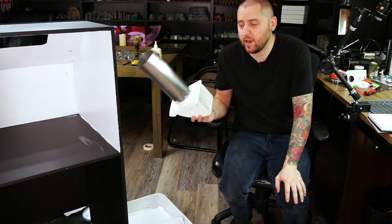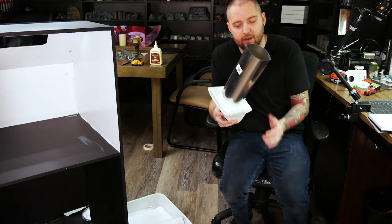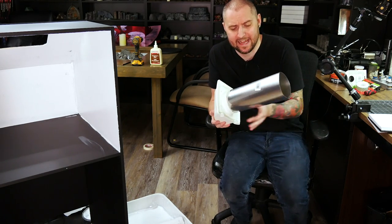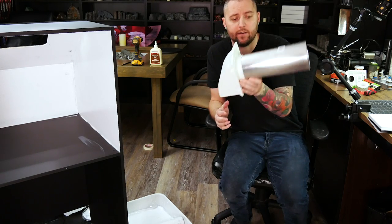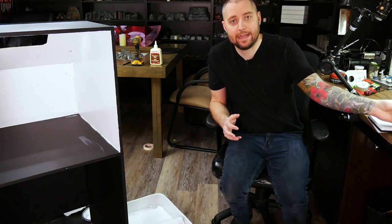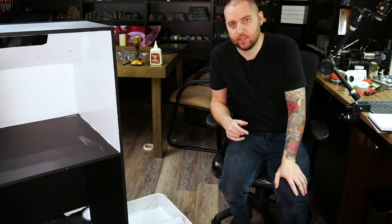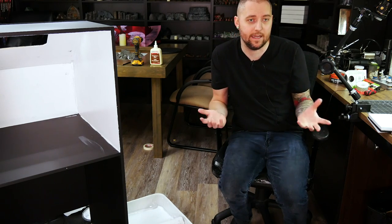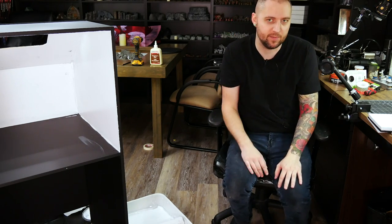While the paint is drying on this thing, I'm gonna start working on the venting, and the biggest part of that task is getting the exhaust vent through the wall. So I first have to drill a hole through my exterior wall. That's always super fun. The biggest challenge is that there's stucco on the outside, so I'll need to use a grinder to cut that out. And the other challenge is hitting a spot where I want it, both inside and outside, without hitting a stud. So wish me luck.